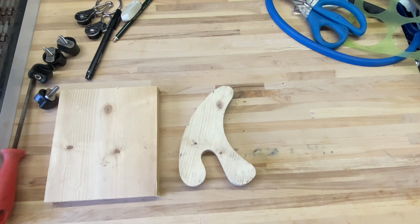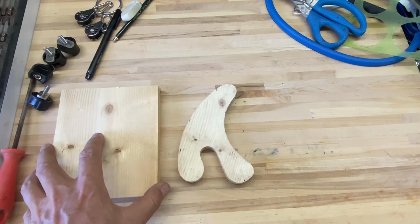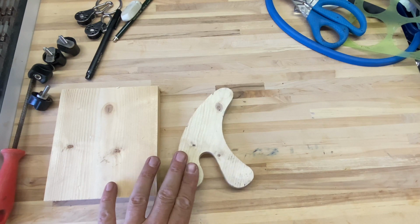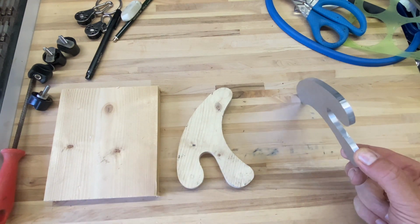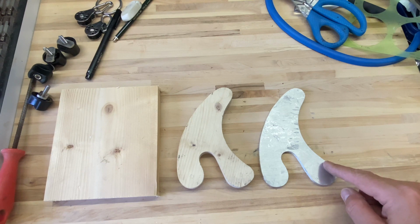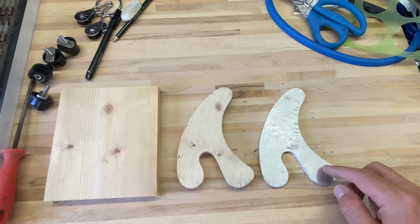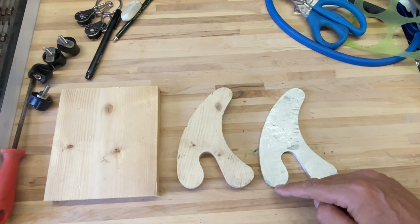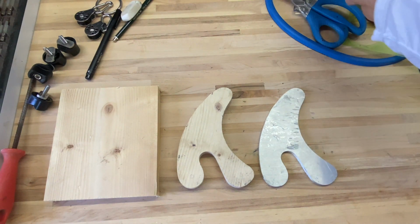So I have decided on a different shape. I just chose to take off as much material as possible, but I had to do the template first. So I made, from just a piece of wood, I think it's 3/4 of an inch, a template, and then got to this shape of the aluminum, which of course is not ready. I'm still to make another one, and I'm still to punch the holes in right there. And before the holes, obviously, I will have to route it with a 1/4-inch router bit, which is pretty much this one, so it doesn't have any sharp edges.